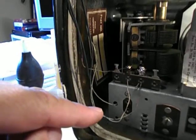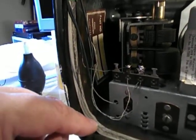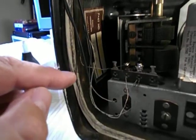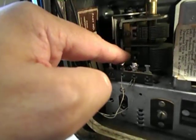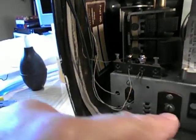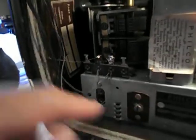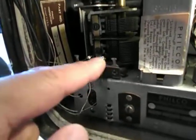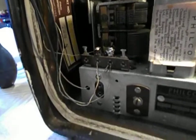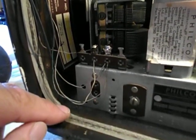One thing about this radio — the antenna wiring was completely wrong. There are two windings within this antenna coil. One is the main antenna winding, which goes between that lug there and chassis ground. The other is a secondary winding, which goes between the external antenna jack terminal and ground again, so it uses induction. Basically, the antenna itself is an antenna coil as well.